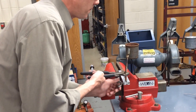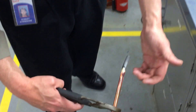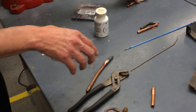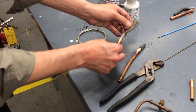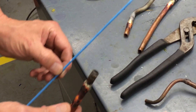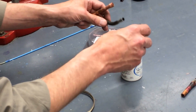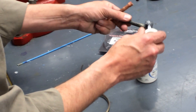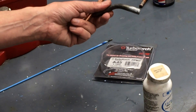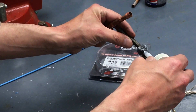Now we're going to do another one. You can let it cool naturally, but you can see it has that nice gold color and not too much discoloration on the copper tubing. This next rod — the Nysil — is going to burn it up. Both sides are going to be discolored. It's just not the best one to use, but we'll go ahead and try it. This one had 45% silver with copper and zinc — mostly silver and copper, 45-55 — whereas the Nysil is nickel and silver.